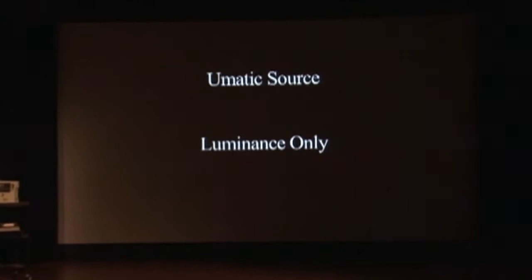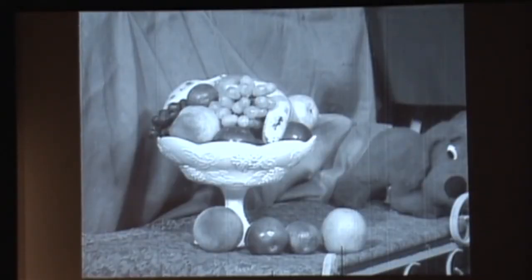So I want to look at the first slide, which is clip number one. If you can switch to the video, great. We talked about what luminance and chrominance is. Let's look at it visually. It's playing. Good. So this is the luminance output of the machine. Black and white information with dropouts and lots of artifacts. Very important here, and this was a trick to do: the same source, and you're looking at just the chroma, no luminance.